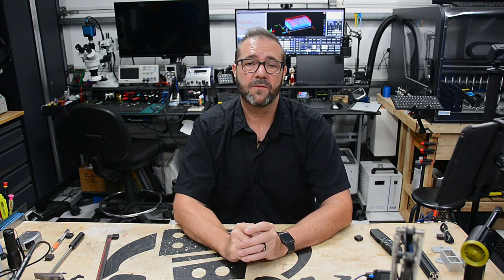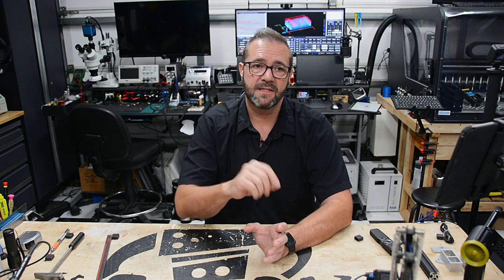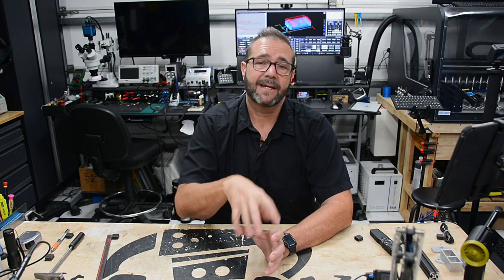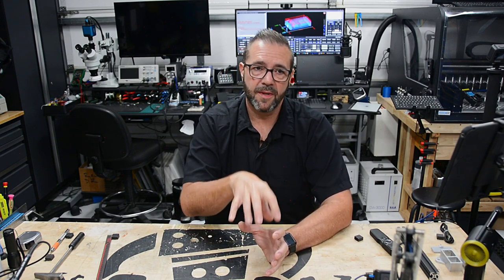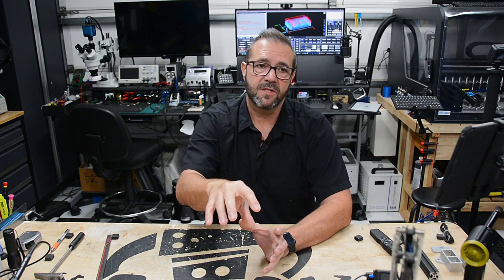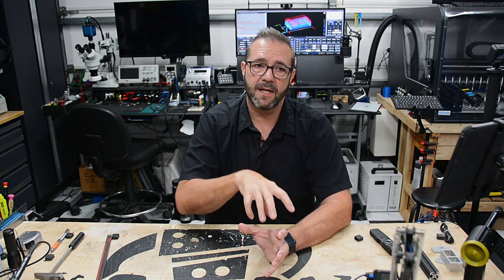capture probe points, which is useful for integration with things like Fusion 360, where one of your operations may be an inspection to collect some data points on your part after you've performed an operation. And then by collecting those data points from the probing or inspection operation, you can feed that back into Fusion 360 to adjust and accommodate to make sure that your part stays in tolerance.